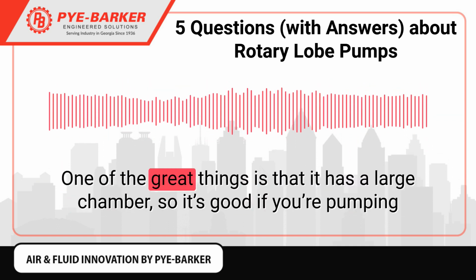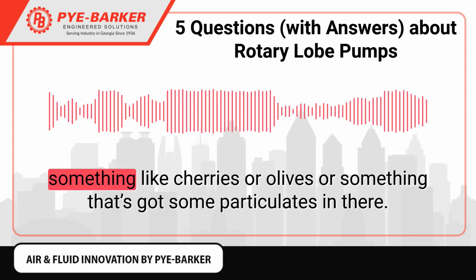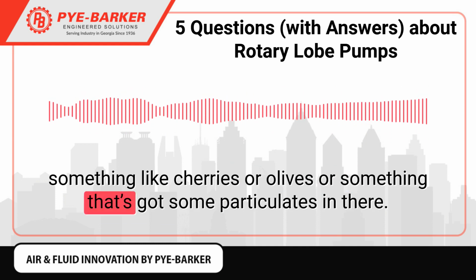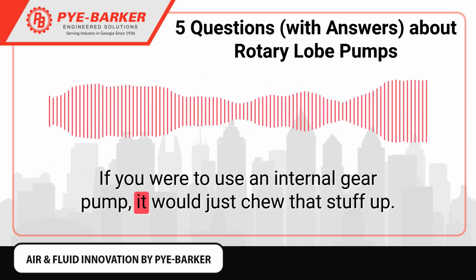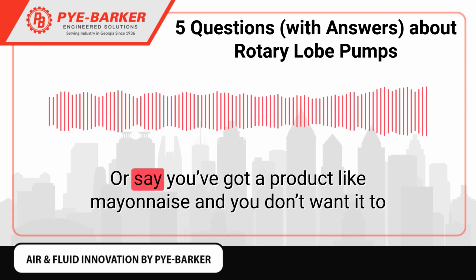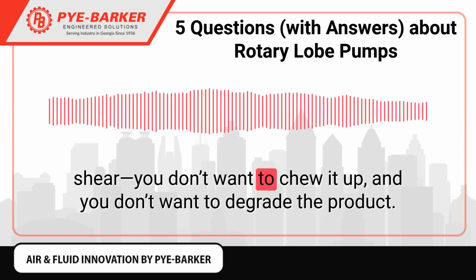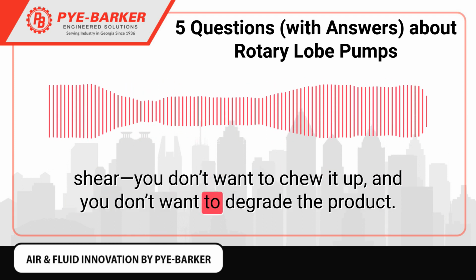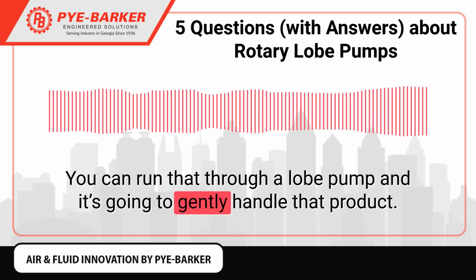One of the great things is that it has a large chamber. So it's good if you're pumping something like cherries or olives or something that's got some particulates in there. If you were to use an internal gear pump, it would just chew that stuff up. Or say you've got a product like mayonnaise and you don't want it to shear. You don't want to chew it up, and you don't want to degrade the product. You can run that through a lobe pump and it's going to gently handle that product.